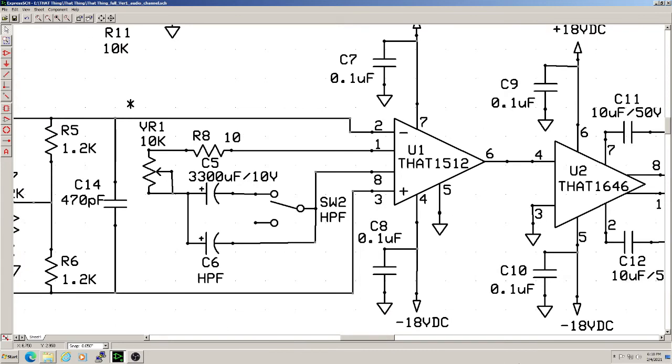Now it's on to the preamp integrated circuit, which does the heavy lifting in terms of gain, up to 60 dB of gain, in fact. While a lot of designs will set the chip at a fixed gain level and introduce level controls somewhere between subsequent stages, ours is a simple mic preamp. It would be a simple matter of just inserting a potentiometer like VR1 across the gain setting pins of the chip, right? Not that easy. Turns out, rapid changes in that resistance can introduce direct current offset in the chip, which translates to thumping and popping on the output.